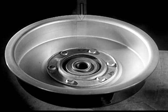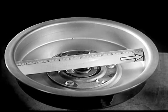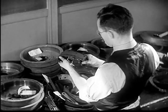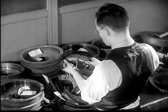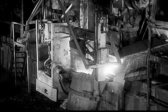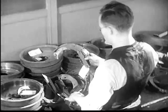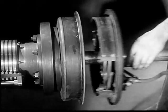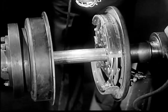Let's look inside this brake. The size of the brake drum is mighty important — it must be wide and large in diameter so that there will be the most possible surface for the brake lining to contact. Chevrolet engineers found out that ordinary steel brake drums were often scorched by the heat from the friction between the lining and the drum, so they developed a special heat-resisting steel from which the brake drum is made. Thousands of different combinations of brake drum and brake lining materials were tested.